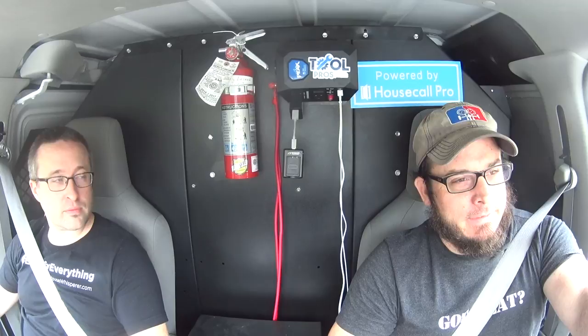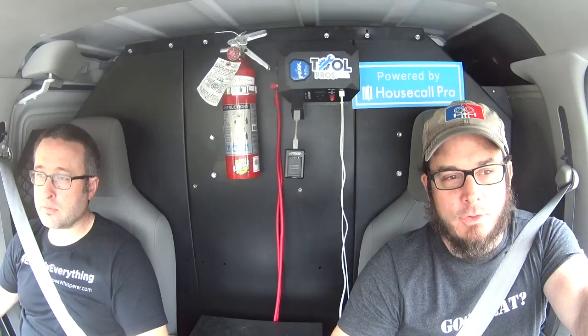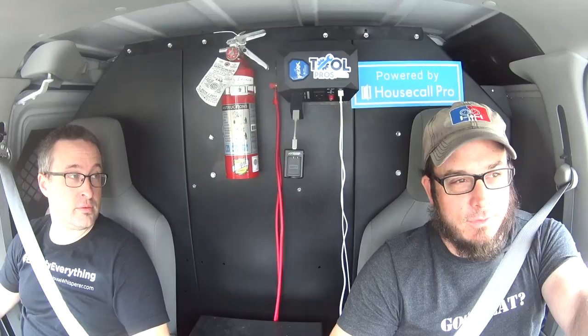The client's complaints are humidity issues and run times under 10 minutes. Oh, geez. As an HVAC guy, I immediately lead to the solution of oversizing. Yeah, which very well could be the case.